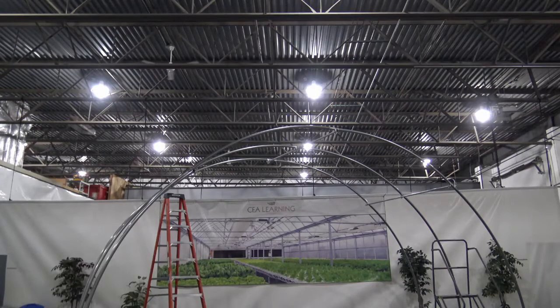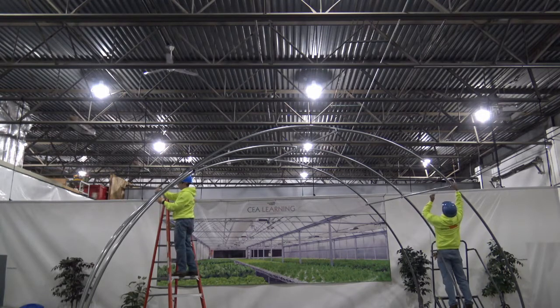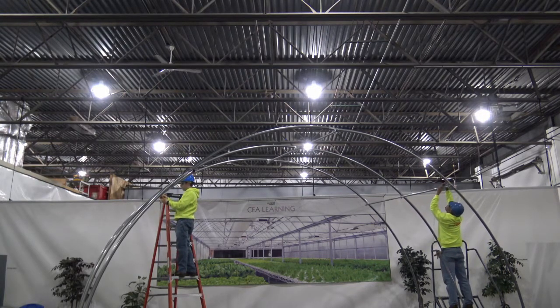Here we will show you how to wrap the cable around the rafter and purlin at the attachment points for this cable. We will follow the same guidelines as before, but do not need the thimble, as here we are wrapping around the rafter. Reserve enough room to get the clamps on.